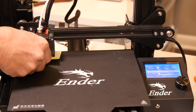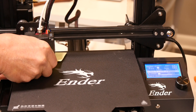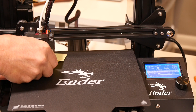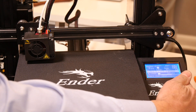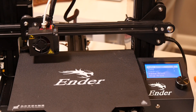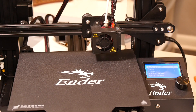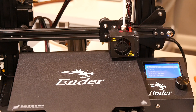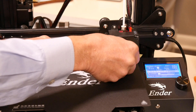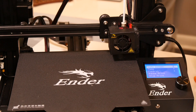I put the post-it note underneath the same way, press on the print bed a little bit. A little bit too loose on this one — make it a little bit tighter. It says 'wait for user' on the front panel; I'll reach over and press it and it will move to the next position. Do I believe this procedure should be included in the firmware for every printer? Absolutely. I'm not sure why it's not, but as you can see it's easy to create. We're ready for the next position — pretty good there. Go to the next position.